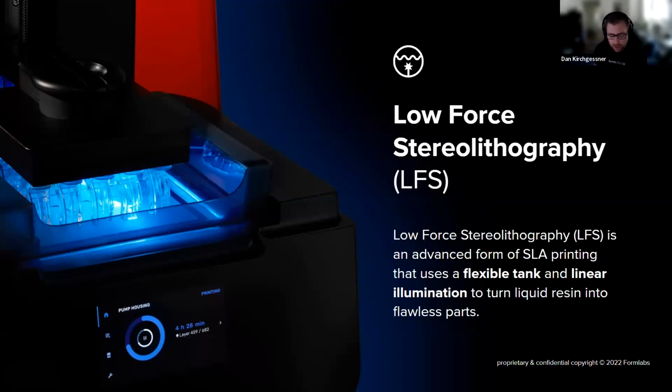If you're aware of SLA, you might know that a big part of the printing process is that you're essentially gluing the part to the bottom of the tank on each layer, and that part needs to become unglued during the printing process. So on our older printers, that would mean the entire tank that holds the resin will shift sideways or tilt to break that layer free. That exerts quite a bit of pressure on the part, which can cause what we call explosions or tearing or warping or all kinds of bad stuff during printing.